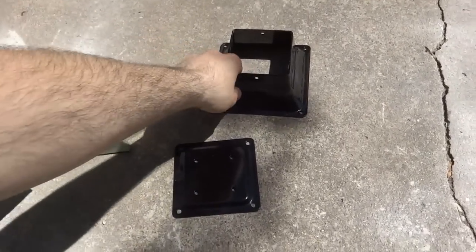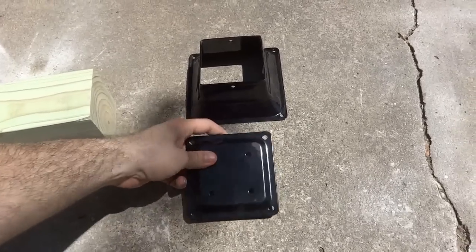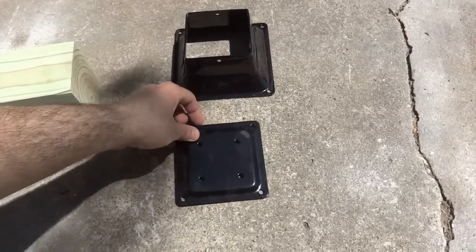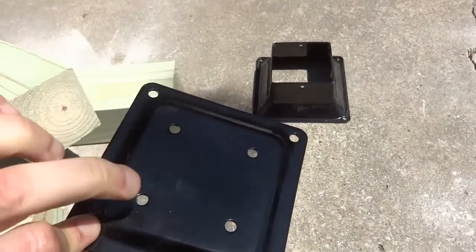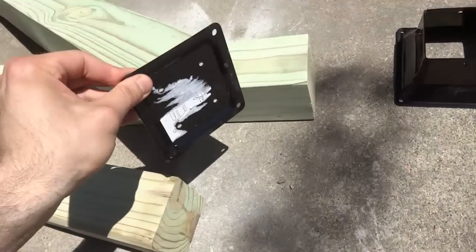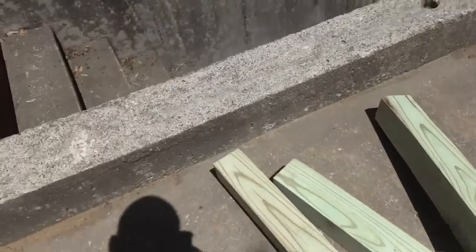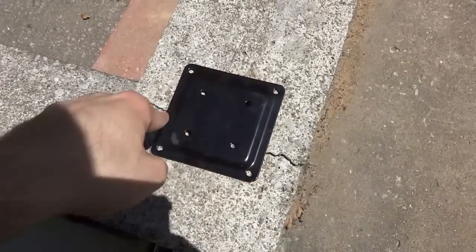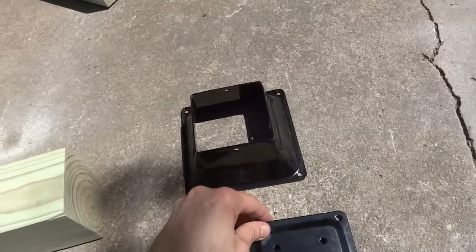So I actually found these brackets online. I don't remember where I got them. I'll look it up and put a link in the description, but they actually had 2 different plates. It should be pretty self-explanatory, but this plate right here, you take the 4 inner holes and you screw it to the bottom of the 4x4. Then once it's all screwed together, you lay it down here on your concrete in the shadow, and then I'm going to have to drill 4 holes, and it'll mount with some Tapcon screws. And then basically the same thing with this plate.